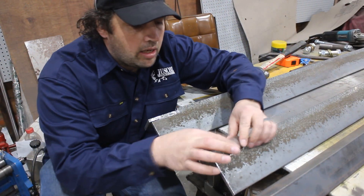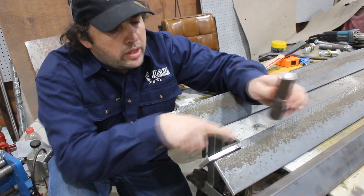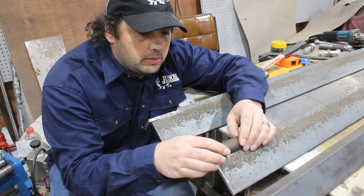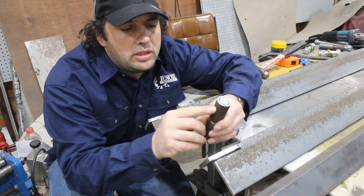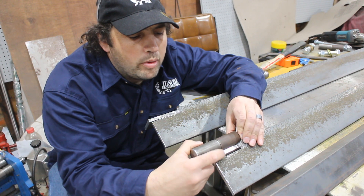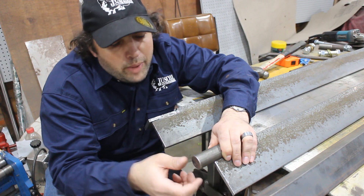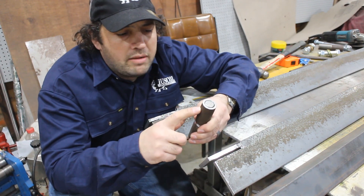I've got all four of these ends cut out for those to sit in. I've cut them out 16 millimeters in each direction so that the corner there lines up with the center of the pivot point — that's important. Because I've only got 25 mil there to weld this to, I'm going to shorten this a bit, probably 15 millimeters, and then I'll have a bit more here to weld onto. There's still plenty of pivot point there. I'm going to leave the ends overhanging for now — I might cut them off later, because that's just a solid block and could be a good lifting point. Next step: cut this down 15 millimeters and then we can start welding things together.